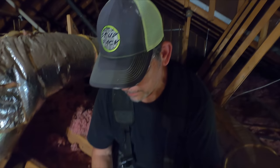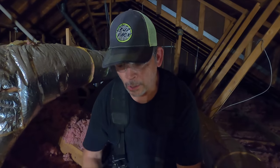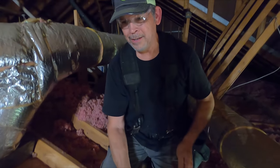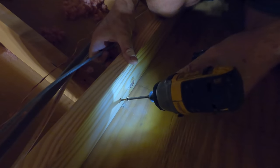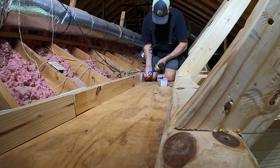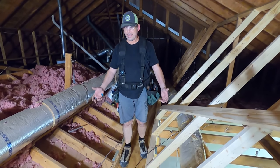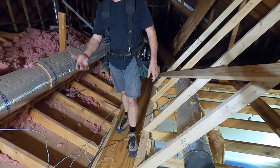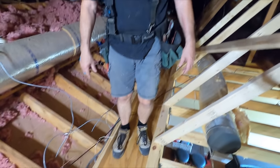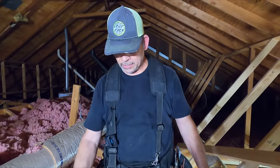All right gang, we're close. Our last step, we're just going to toe screw the 2x4 into the cathedral ceiling 2x6 — probably overkill, but it's going to stiffen this up a lot. It's a little spongy, but your feet are going to be out to the side anyway. The catwalk is almost done — this is great. All we need now is an OSHA-approved handrail and some aisle lighting. We've got one thing left where the plywood joints are — it's a little sketchy — so we're going to cut some blocks, attach those, and we'll be done with this catwalk.